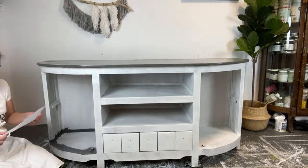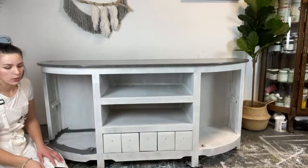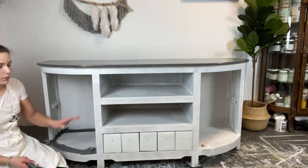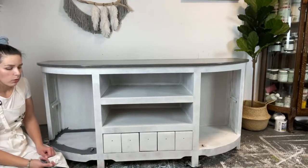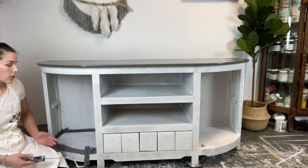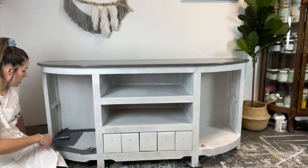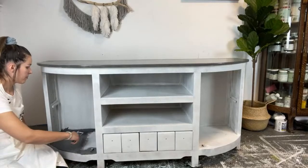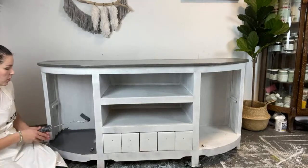Another question: do you always paint three coats of paint? This just depends on what I'm working on. So if it was a color like this over top of white primer, it's going to take three to four coats. If I was painting white, I would do two coats of primer and then four coats of paint — six coats total. It really just depends what you're covering. On average, I like to do at least three, just so I know everything is super covered.